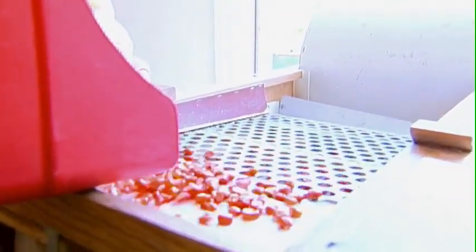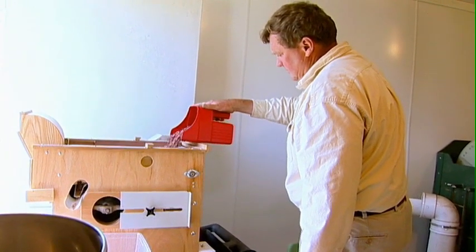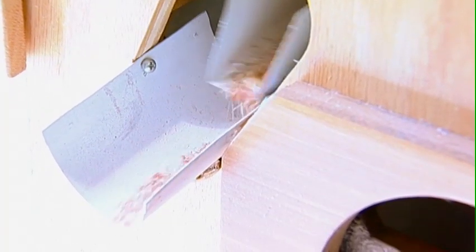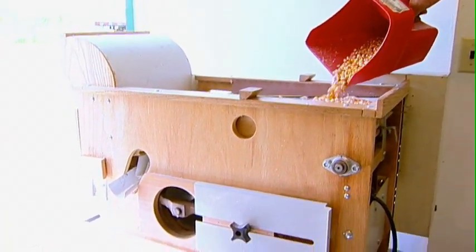This process is number one to pull off any small kernels — we don't want to plant small kernels. We want nice, big, fat kernels. It also cleans the seeds so silk and debris inside the seeder doesn't clog the holes and cause skips and problems out in the field.